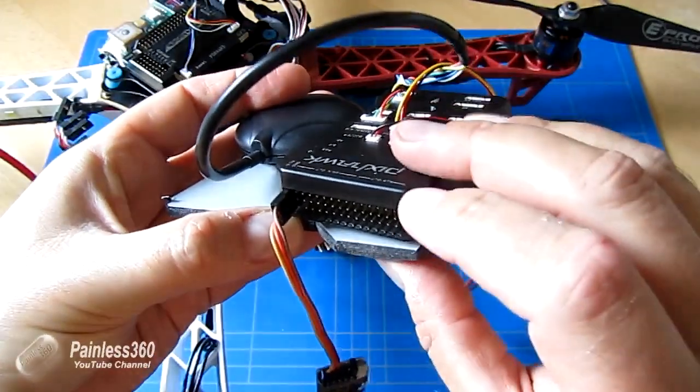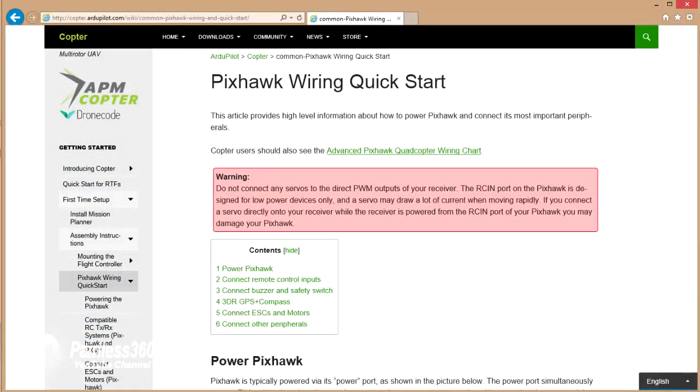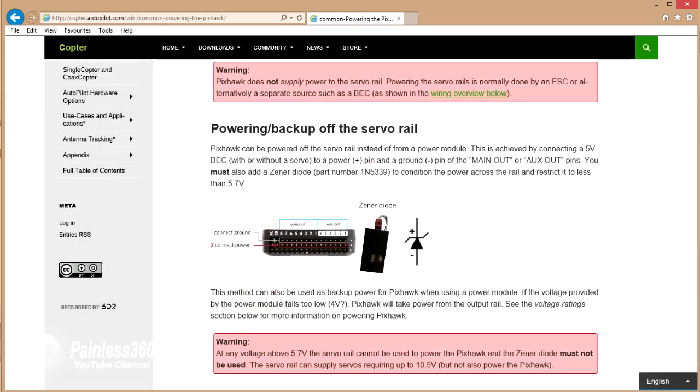The reason for that is that when you connect it over the powering connections at the back, you really need to use something called a Zener diode. So in here you can actually see the instructions on the PixHawk website. So we're looking at copter.ardupilot.com/wiki/common-pixhawk-wiring-and-quick-start. I'll put the link in the description so you don't have to type all that. But it's very good. It actually explains exactly about where you plug in the power module into the power port into the bottom left hand corner that we've just seen. And it also talks about powering the PixHawk off the servo rail.